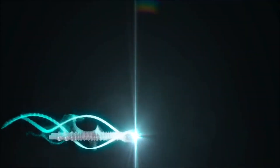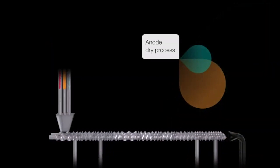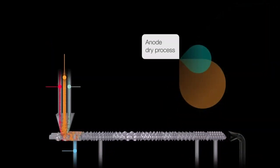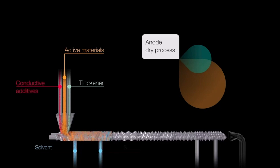Previous reports have shown that the addition of LAGP particles in hybrid electrolytes is beneficial for enhancing lithium-ion migration, which is a positive for the performance of the battery. When the mass of the LAGP nanoparticles is above 50%, the paste does not flow for more than 24 hours in a sample tube inversion test, thus showing a strong gelation.